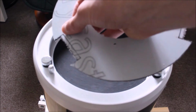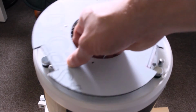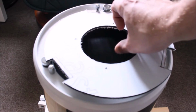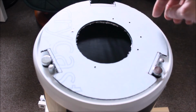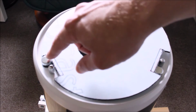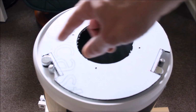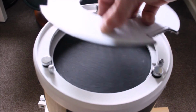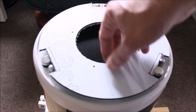As you can see, I've just milled out the slots using the Dremel. Now, as you can see from this picture, I've had to measure another extra 5mm on either side, because this does not fit precise. Okay, so I want this so that I'll be able to fit it and do the collimation. I've got to recut them. As I always said before, better to under measure than over measure, because if you overcut, it means you've wasted some Perspex plastic and you're going to have to buy a new sheet and then start again.